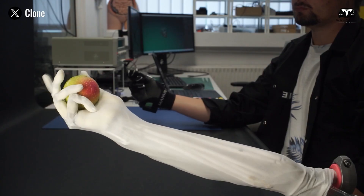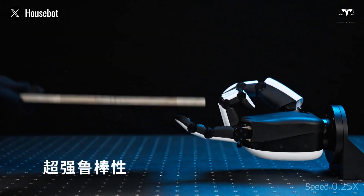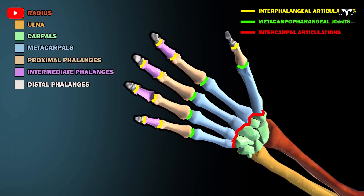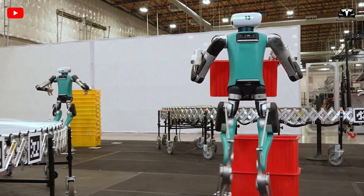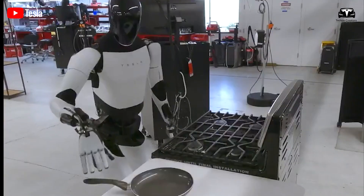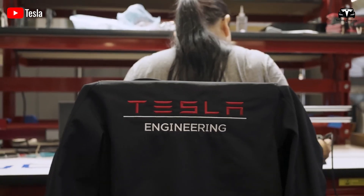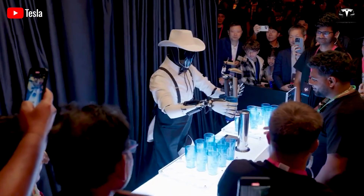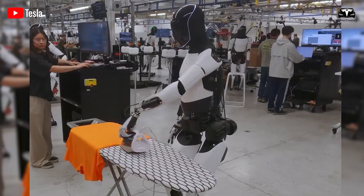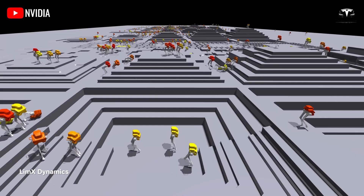Perhaps the most futuristic feature of Apex Hand lies in its tactile system. Dexcel Robotics has designed an in-house flexible electronic interface with communication latency under one millisecond and a refresh rate exceeding 1,000 hertz, meaning the hand can sense and respond to touch nearly instantaneously. Human tactile nerves transmit signals at speeds up to 120 meters per second, which also translates to millisecond response times. By reaching similar temporal fidelity, Apex Hand effectively mimics one of the most critical sensory feedback loops of the human body. For Tesla Optimus, tactile sensing would enable safe handling of fragile objects, adaptive grip on uneven surfaces, and real-time correction during tool use.